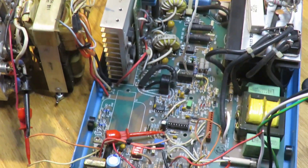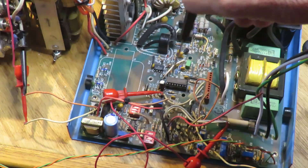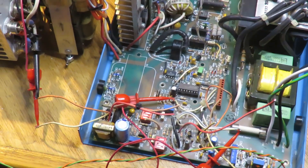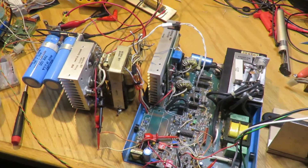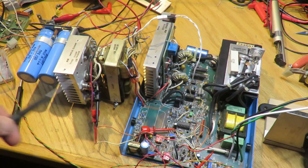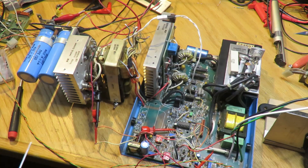The other thing I noticed is that the AC ground and other nodes around the board are grounded to the chassis — so without the chassis installed all those connections are missing. That's why I've been running it with the chassis. What I really need to do next is build a metal or wooden base plate to hold these heavy components in place while I work on it, because I don't want to damage the three wires connecting everything.